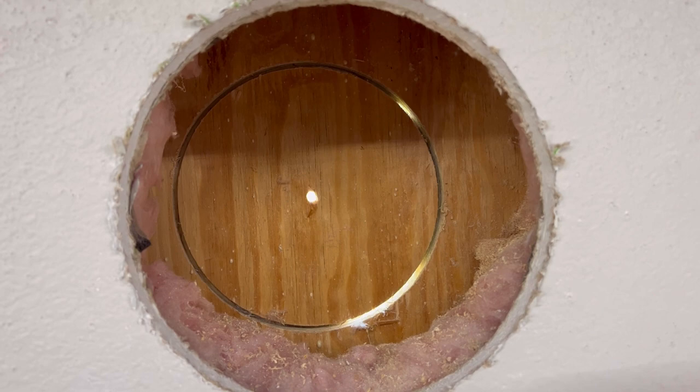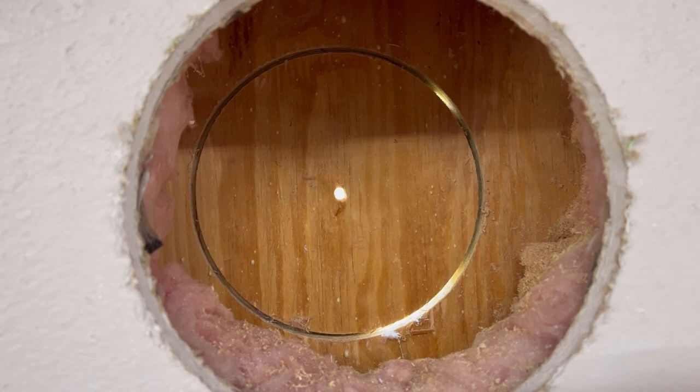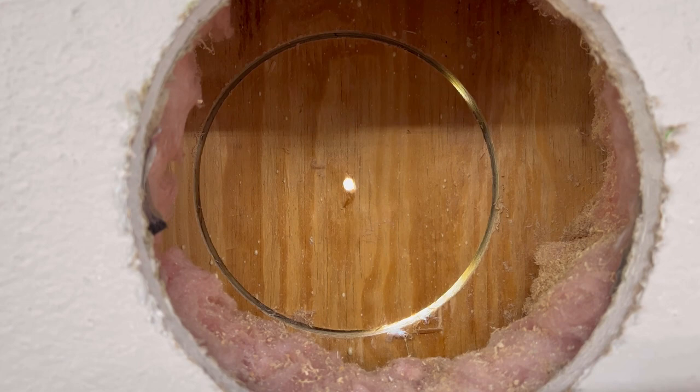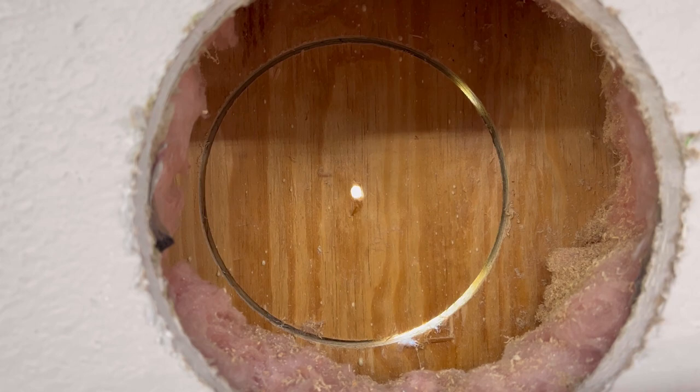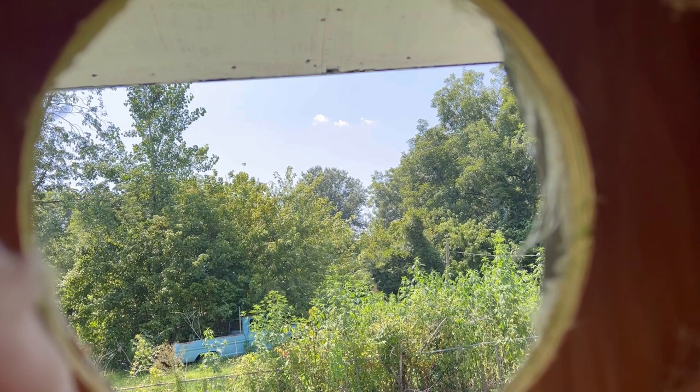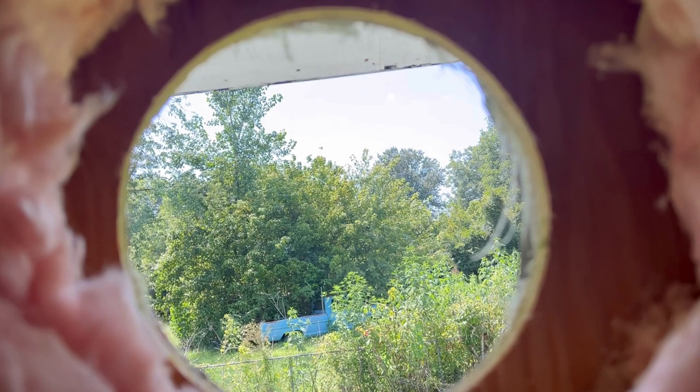There are a number of reasons I'm going to cut the metal siding with a pair of shears and not with a blade. When you cut metal siding with a blade, especially on a hot day like today, it'll make sparks — and you can see it's a wood underlayment, so sparks are dangerous. I'm going outside with a pair of metal shears to finish cutting it. We've got that sheet metal cut on the outside — that was a hot job because it is over 100 degrees outside. You can see the metal siding, the wrap, the under-sheathing, and a rare look at the pink batting inside.